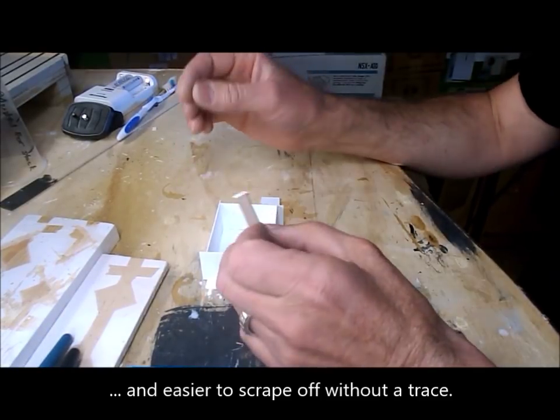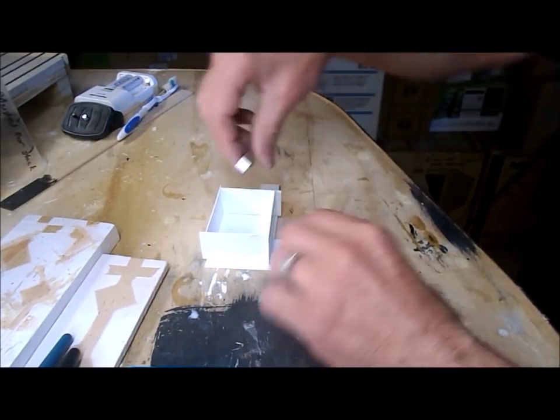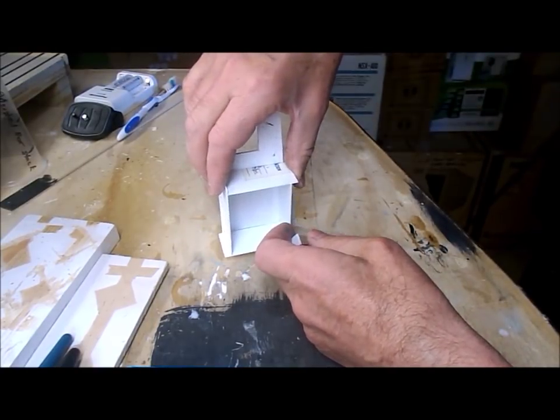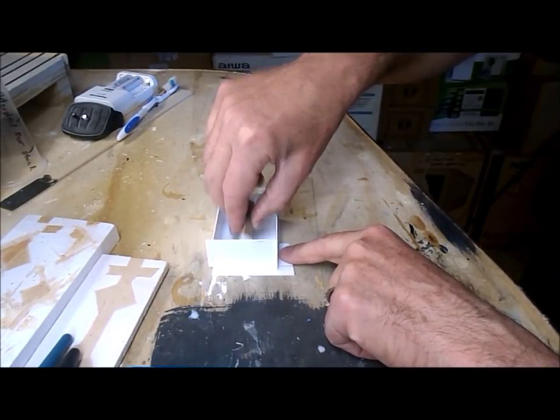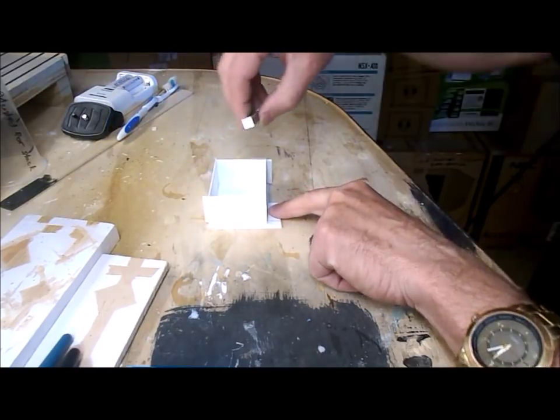Now, unlike my one-piece molds where I'm putting the master at the top, here the master gets put against the end wall and the mold will eventually be stood up to pour into. So the mold box you'll see is a lot deeper, because the master will go halfway up it instead of right at the top.